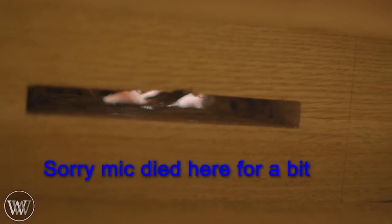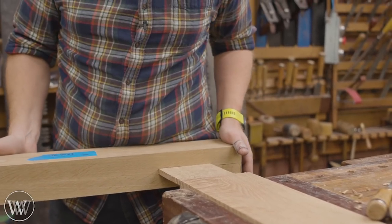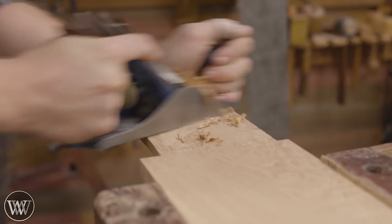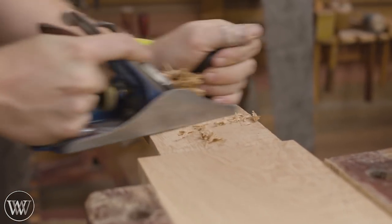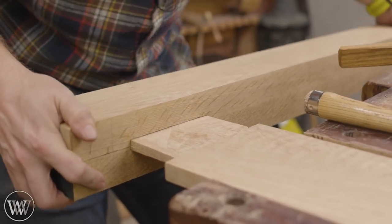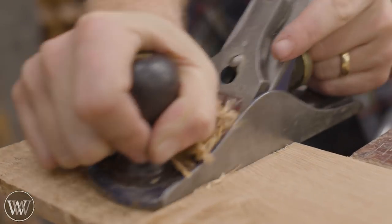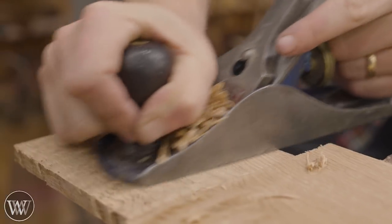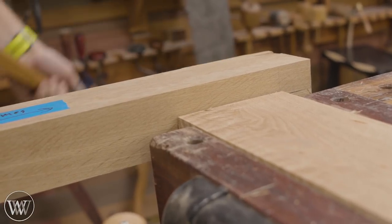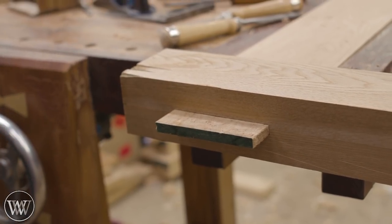Here you can see me popping through - a lot of fun. The mic died here for some reason; we just didn't check the battery. Now we can take it back over to the tenon and test it back and forth and see how it goes. This is a lot of trial and error - in this case I just needed to clean up the tenon a little bit, thin it out in a few spots, until it would wiggle down. It slid in a little bit farther each time. It's all about taking your time and seeing where it's tight, being able to remove material where you need to remove it and not where you don't, until it slides all the way on and you've got a nice fitting mortise over your tenon. I'm really happy with that - it's sticking out a lot longer than it needs to because I'm going to be cutting it off in the future.